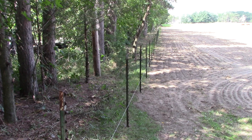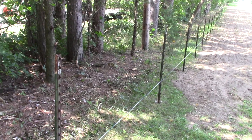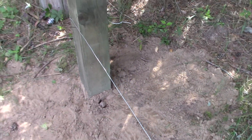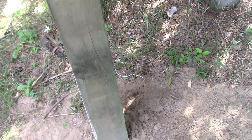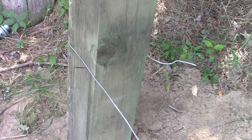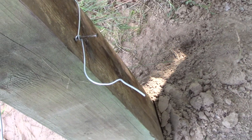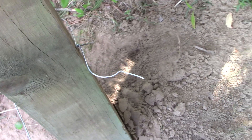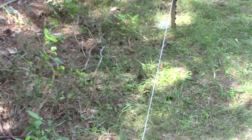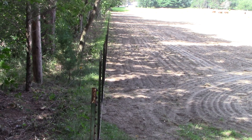We're still going to have one electric wire running along at about 30 inches up. To get a pretty straight line — it's tough to set up a laser out here — we just took a strand of our galvanized electric wire, smooth wire, and put a couple of nails in the 6x6, one on each side. The one on this side holds the wire from sagging down. On the opposite side, we drove a nail in and did a simple loop so we can stretch it and remove it when done. We kept the roll intact on the other end so that wire acts as our guide — kind of an older way of doing it, but they turn out pretty well and you get pretty accurate.